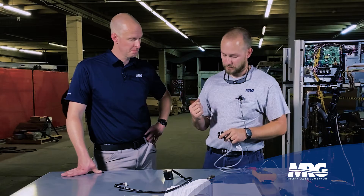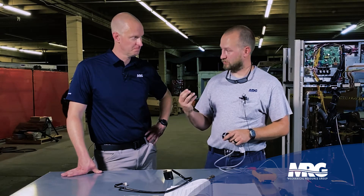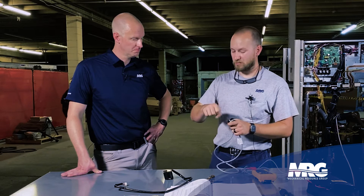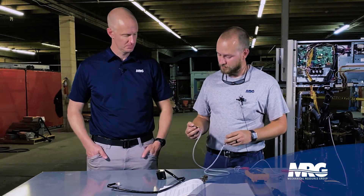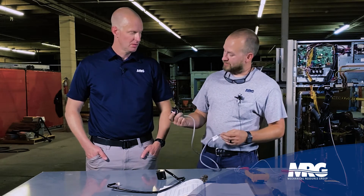To clean the clip-on style, pop it off — it might be a little tight at first, especially if there's rust. If there's any rust inside, clean it out. I like to use Scotch-Brite; sometimes a pipe fitting brush or battery terminal brush works well. The actual valve body itself — same thing, Scotch-Brite, twist it around, clean it up. When rust builds up inside an EEV, it can no longer control properly, so the board sends a command but the EEV doesn't respond.